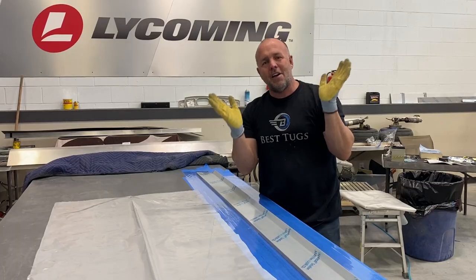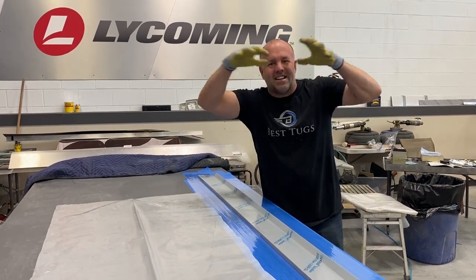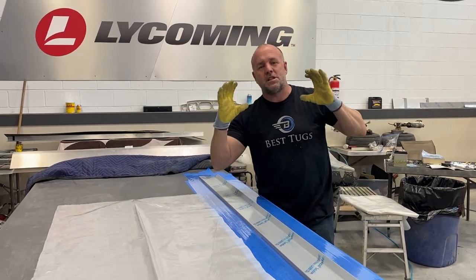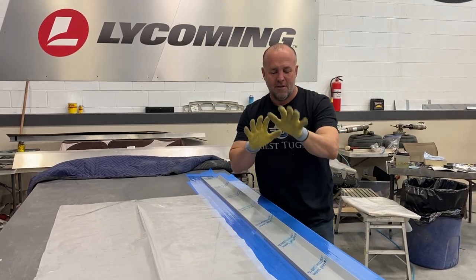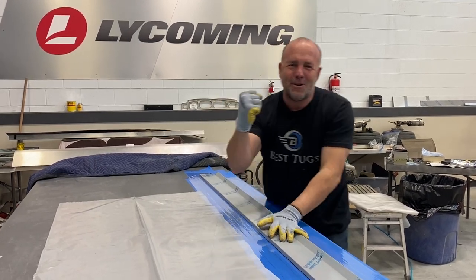So rather than rubber baffles sitting against my cowling, I'm making an entire airtight carbon fiber box that rubber boots to the front of my two intake. Absolutely no air will escape it except through the cylinder. So this is one of the parts. We got a lot to do. You know the drill. Back to work.